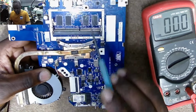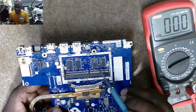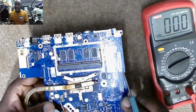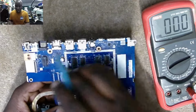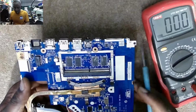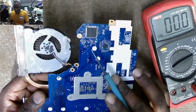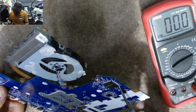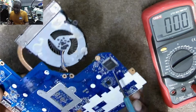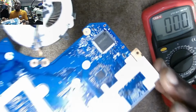Network card, RAM slot, and we have the onboard RAM memory. You can see those chips. That's onboard RAM memory. Even without this RAM, this motherboard has to display. Okay. Here we have Lenovo IT8586E. That's the EC chip. Can you see this EC chip? Fine.